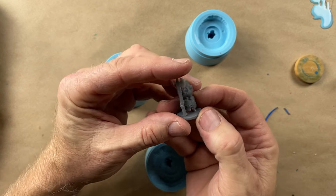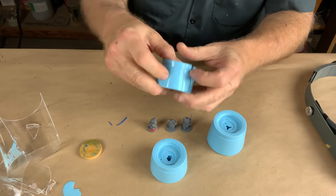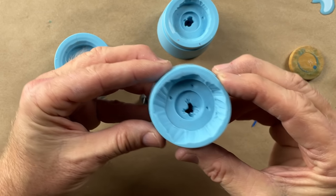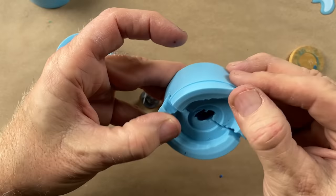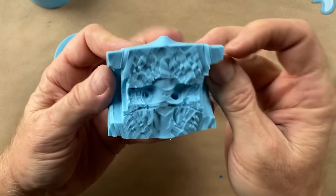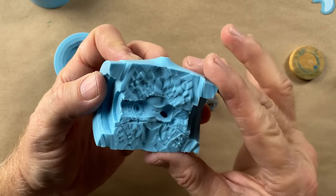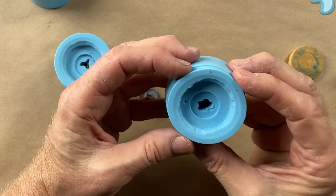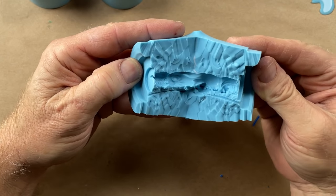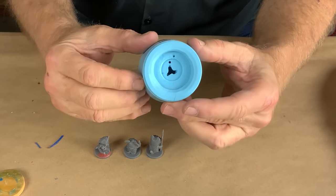All our little guys came out of the molds just fine — no problems at all, no breaks. The molds themselves are nice and complex but came out just fine. Closing up nice. This was the first one we cut, and that's just about as clean a cut mold as you can get. Now you understand the power of those jagged surfaces — they don't need to be wildly interlocking, but these surfaces will just fall together and lock together, just as neat as can be. I'm fully expecting very minimal parting lines. Let's band these molds up and pour some resin.